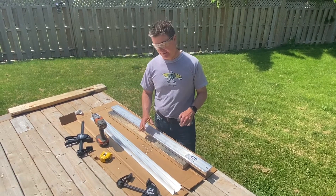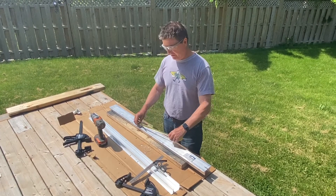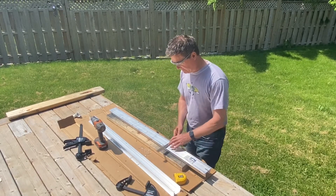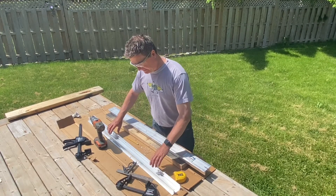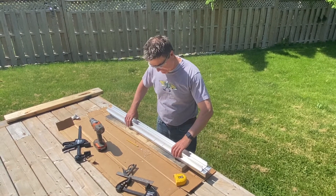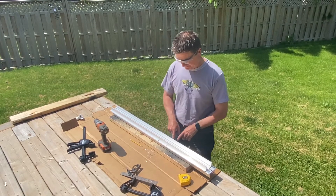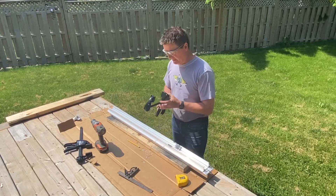In this example, I wanted to move the mounting holes up 12 inches from the existing mounting holes. I took my tape, marked a mark at one foot, used my square and drew a line. Then with the second arm, I placed it over top of the second mast precisely and positioned it so I can see the pencil line through there.